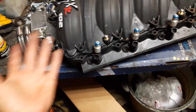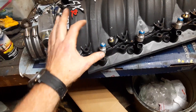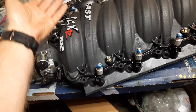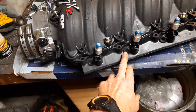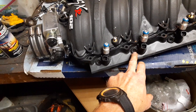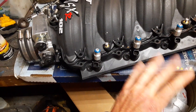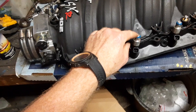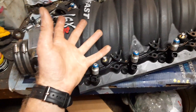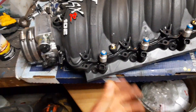If you're unfamiliar with what that means, there's tons of videos on the difference between wet and dry nitrous. Progressive dry means it's going to flutter the solenoid to start the nitrous shot off low and progressively get more and more as the RPM goes up. I'm doing that with direct port instead of a plate system. Since it's a dry system, I'll only have one nitrous line going to each port. My computer will compensate for fuel at the injector. These are 76 pound injectors, way bigger than what I need naturally aspirated, so they're big enough to compensate for the motor and quite a bit of nitrous.